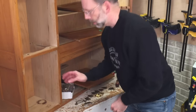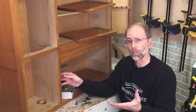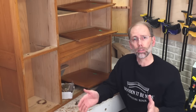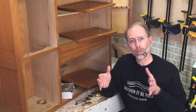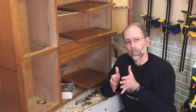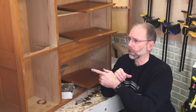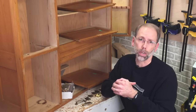on this side. Now, as I prepare to put shelves in this side here, I'm a little bit more puzzled about this cabinet. The center and the bottom and top are all made out of solid wood, but on the end, we've got frame and panel. Frame and panel is great because it controls wood movement and creates a stable cabinet. But in the center here, I've got a center that will be expanding in the summertime and contracting in the wintertime. A very puzzling mix. So I'm suspecting it was an amateur woodworker that put this cabinet together, not a manufacturer.